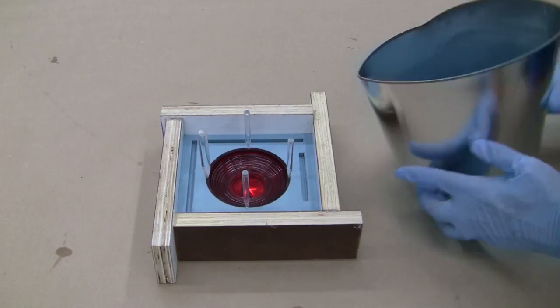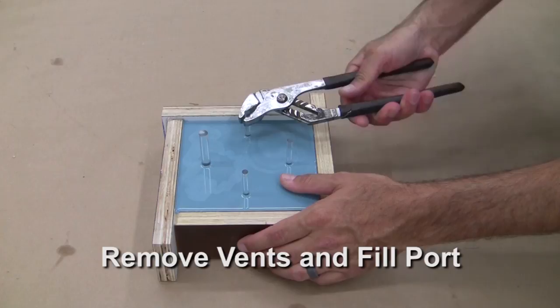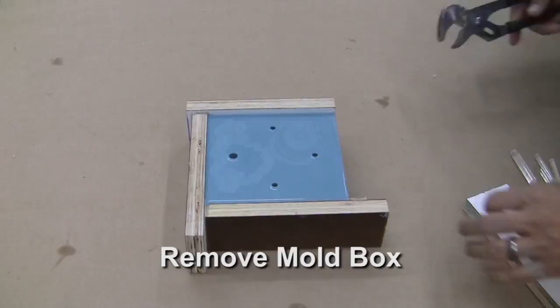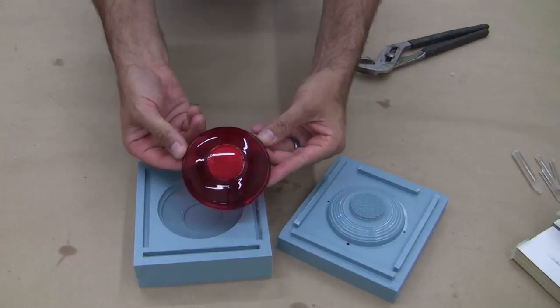It's now time to pour our second silicone mold half. Once again, we pour slowly and carefully to avoid creating unnecessary bubbles, filling all the way to the top. Once the silicone is cured, we begin the process of removing the acrylic vents and fill port — a quick twist with pliers breaks loose the glue bond and they pull right out. Next we remove the mold box to reveal the two silicone halves. Begin slowly separating the two mold halves, being careful of the molded-in registration keys. And there we have it: a beautiful recreation of the shiny surface of the lens, ready to make more lenses.